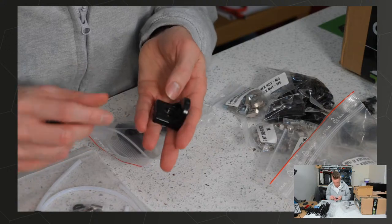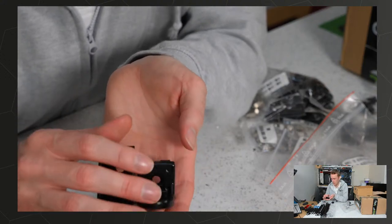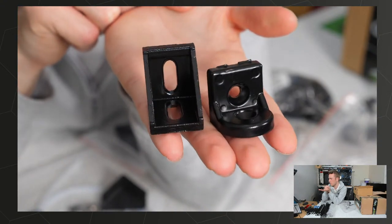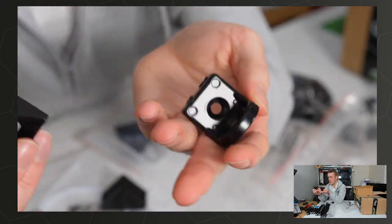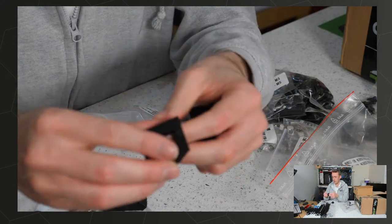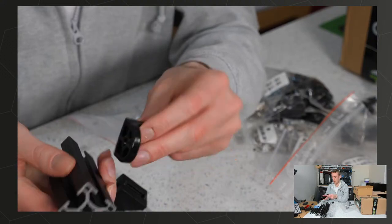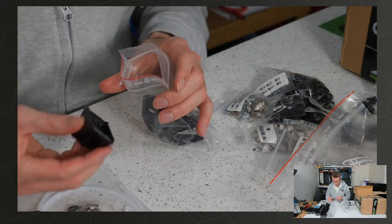There are also some rounded brackets which look like they're for the spool holder - these are designed to be able to fit and rotate in either direction, whereas the standard ones can only mount one way. We've also got PTFE tubes, nuts and screws, and belts. The belts are labelled as 2GT-9 but are not Gates belts unfortunately. I've not done testing to show significant difference between these and Gates belts, but Gates are the industry standard. The 9mm belt is presumably for the Y axis with the bed movement.